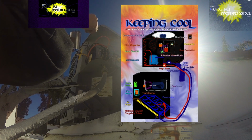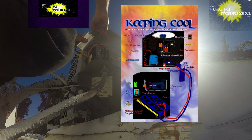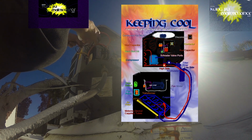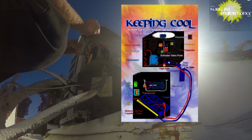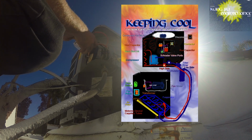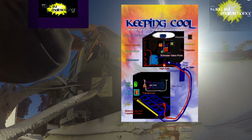Go ahead and get our common in the center on this one. So I've got my red and blue, purple, probably kind of in between, indigo. Okay, got our fan by itself on the left on this one, and the start wires on the right on this capacitor. So the start is hermetic compressor. It leads straight to the yellow start wire for the compressor. At least that's the colors for Goodman. And then here's our fan. Other manufacturers use different colors, just so you know.